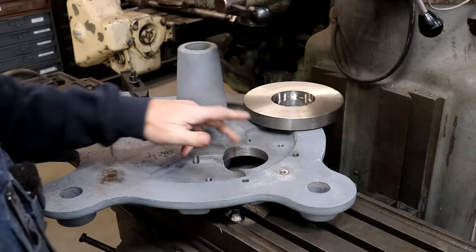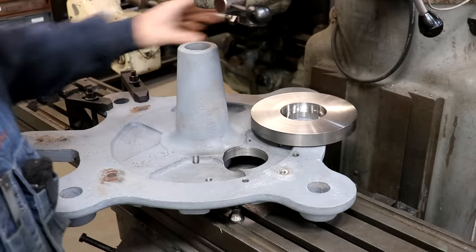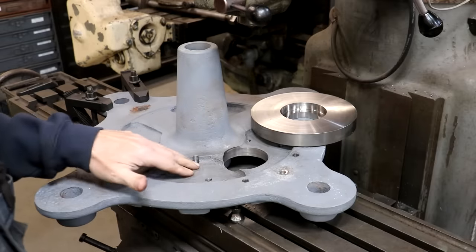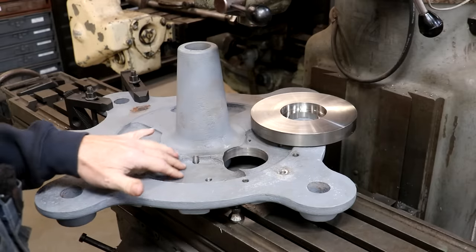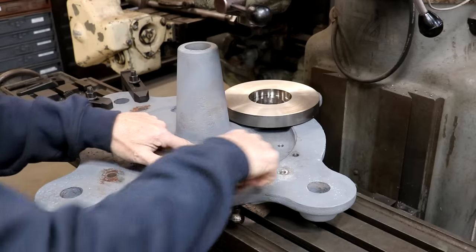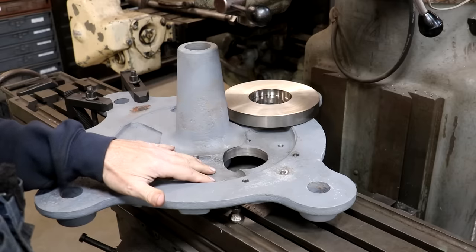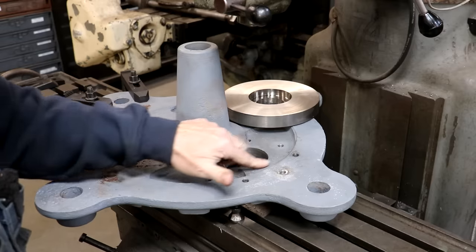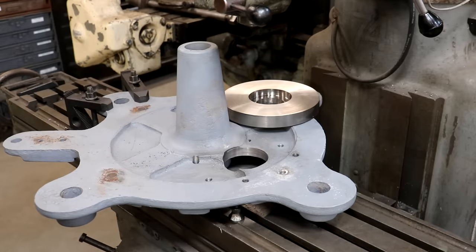Previously, we've come in here and bored out a hole, put a bolt hole pattern in that we're going to be mounting this adapter flange to. We've still got to do some machining to this adapter flange so it will fit down in here. We're basically going to be milling these areas out so it'll be clamping directly down into the casting. But before I can do that, I need to clean these surfaces up. This is all rough casting — machined here and here, but all this area in here is just rough casting. It's not a flat machine surface we can clamp down onto. It's got irregularities — higher here, lower here. I need to deck that off and flatten it out a little bit.